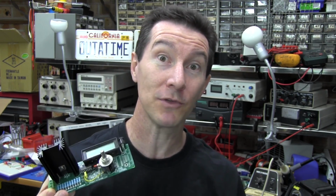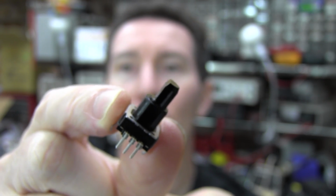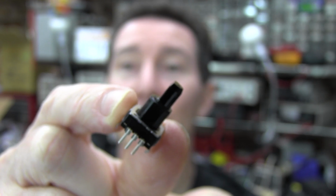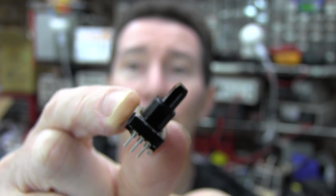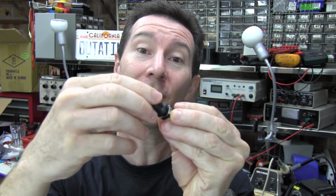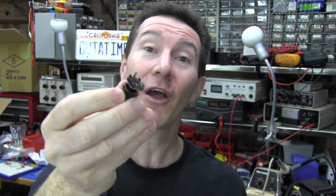That doesn't include the knobs. And if you're going for digital control, then instead of a pot, because you're still going to have a knob on the front panel unless you use switches, you're going to use one of these rotary encoders, and they're pretty cheap. They're only about 50 cents each, under $1. And you just put a little cheap knob on the top, and then you've got complete control. That is more than 10 turns. That's an infinite number of turns. So these rotary encoders are great.